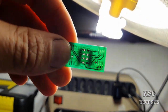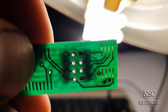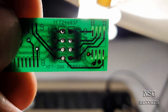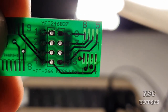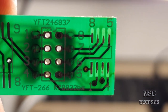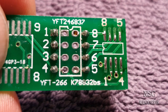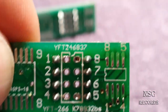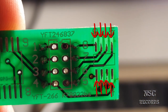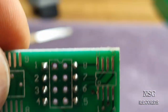Now with the lights I'm going to show you that the contact is really not there. You can see it perfectly — this is not just talk, this one is broken. You can see the contacts underneath, but all the rest is just damaged. Without lights you might not see it easily, but with some light you can see that the traces are just missing or destroyed.